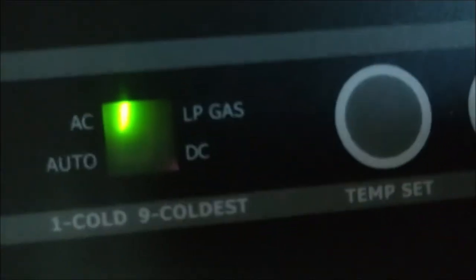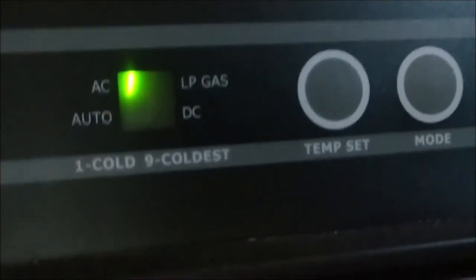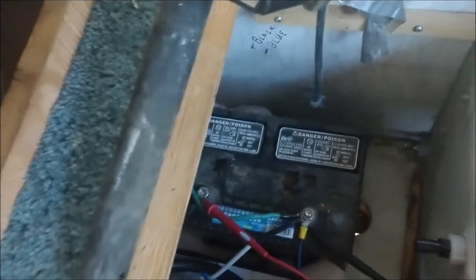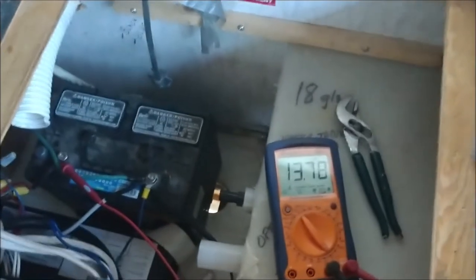Really happy with the progress - got that done. The power center is in. Took out this old one right here - this is the Magnetek, I believe the 6300 series. It was working fine except I don't believe it was charging the battery - that was the issue, I think. I didn't verify that fully, but the battery was pretty old - about 10-15 years old, it was probably junk anyway. That's just the battery I had here, bought for my winch - it's a deep cycle, pretty good sized battery. I've got another one too.